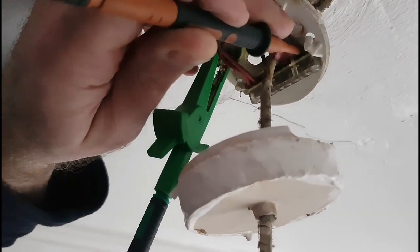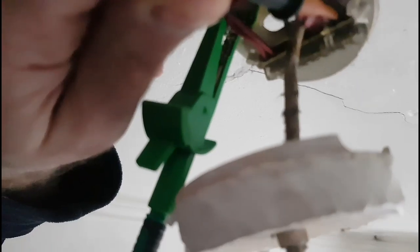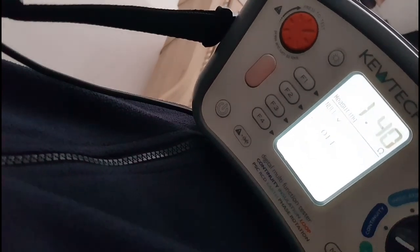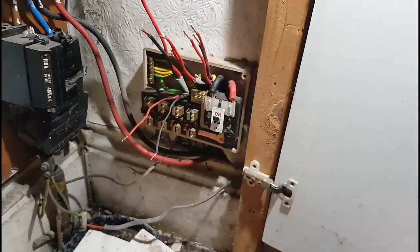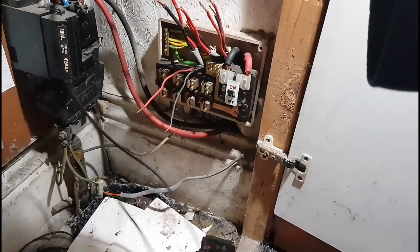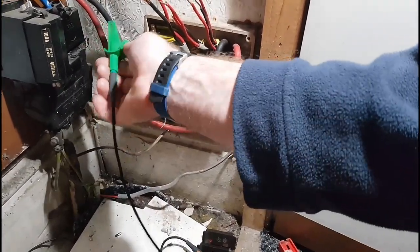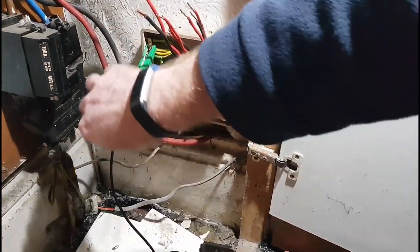I can reveal that this is the actual end of line on the lighting circuit. I've obviously connected the crocodile clip up there and all the leads again. I'm getting about — it's quite unstable, but it's settling around the 60s mark — 0.66, I think we saw it there. Right, let's skip through a few stages of the procedure here, but I've done them, I've just not filmed them. We're doing the insulation resistance on the lighting circuit now. I've disconnected the other two 1mm circuits.